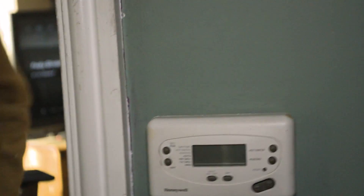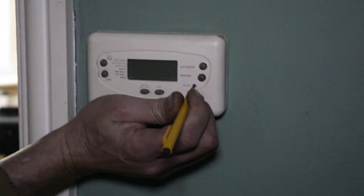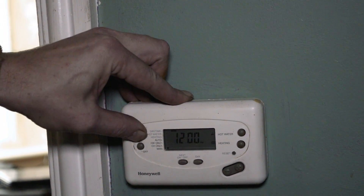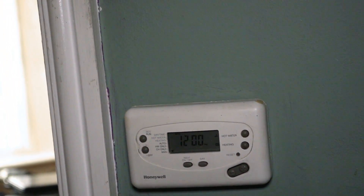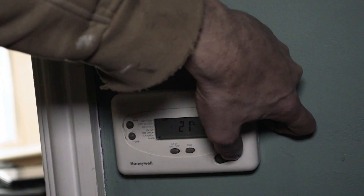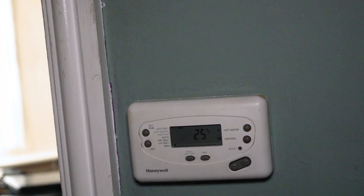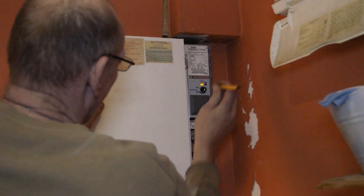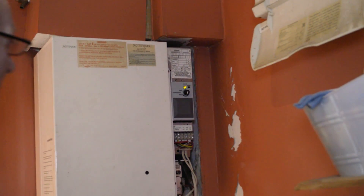That's on the power now. Because we've had the power off, the thermostat unit just needs resetting to start up. I'm going to set this to manual, with my heating on and my water on. I'm going to put my thermostat up to 25, and then go and start my boiler. I'm showing an amber, and when I reset — just reset it — it should now kick up and fire up. Voila! One repaired boiler.